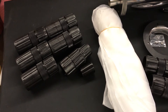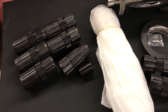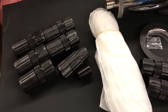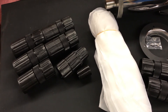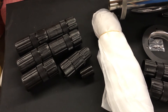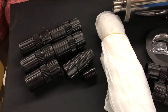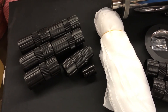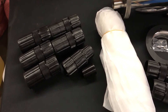Guys who know don't use whip hoses. Air flow is a function of the cross-sectional area of what we're flowing through — in our case, vac hose. The area of a hose is the area of a circle, which is pi r squared. Pi is a constant. R is a variable — R is half the diameter. You square it, you're talking about an exponential function. It doesn't take much increase or decrease in the radius of the hose to cause an exponential increase or decrease in suction.